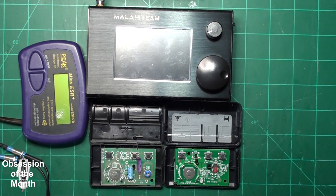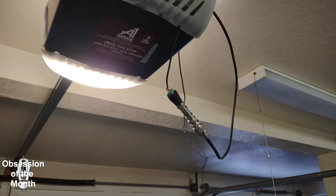I was still having problems with the handheld remotes, but the Homelink in the car was back to normal. What I found was that I had to basically relearn all the remotes to the garage door opener — I think the memory in the garage door opener may have become corrupt. All this work did help and did increase distance in some cases. After I relearned everything, all the remotes started working from about 50 feet away.